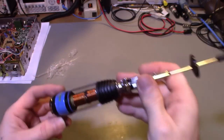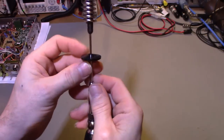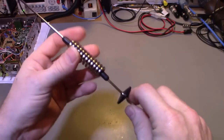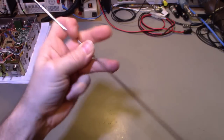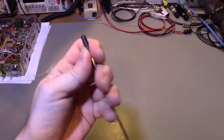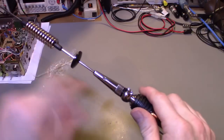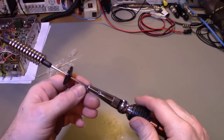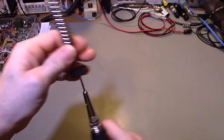So it's the bottom-loaded antenna. Now, I'm not sure what this little UFO is supposed to do here in the middle. I'm sure it has a purpose. It's got a coil midway up. Nice rigid antenna element. Nice little tip. That looks like that's on there to stay. That thing's not coming off anytime soon. Adjustable, yes, for SWR, so just loosen the set screw with the supplied Allen wrench and then move your antenna up and down.